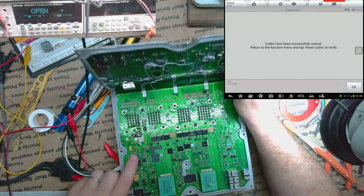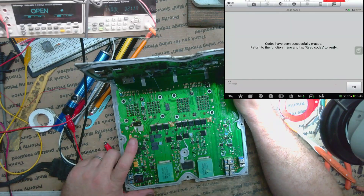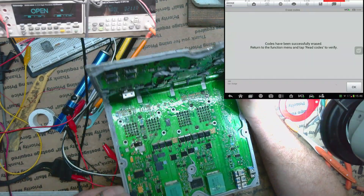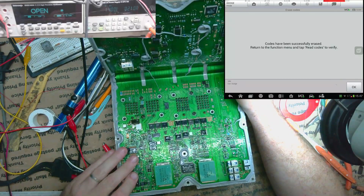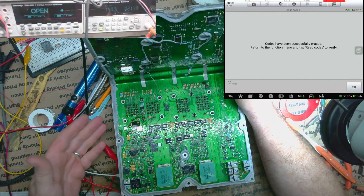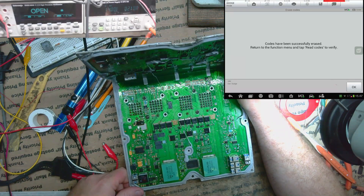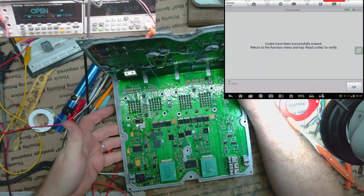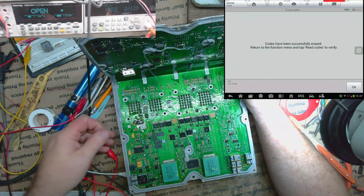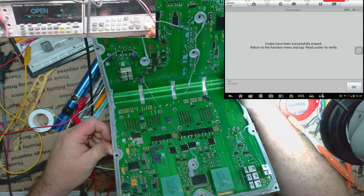Customer almost had it. I'm not familiar with the other guy's video — I know the name but not the video where he worked on one of these. But if he cut that out, that's not a good way to do it. Breaking it off is not a good way either. You just have to take it off properly — you just need pretty high heat. Either preheat the whole thing and then use your iron, or personally I use hot air and iron together. But yeah, almost.